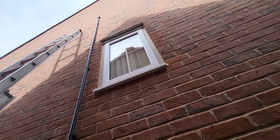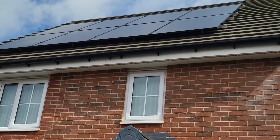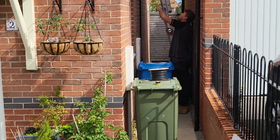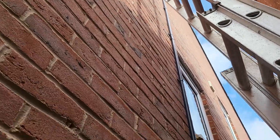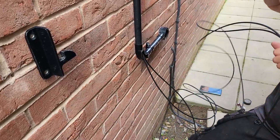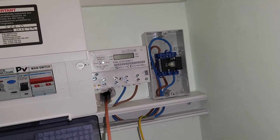He's also trying to get this AC cable drawn back up the conduit with some DC cables attached onto it, so we're using that as our draw wire. As I said, we're going to bring the DC string power down into this cupboard space. You can see Matthew here measuring the length of DC cable he needs to fasten on while Nathan draws that up into the loft space to join onto those existing string wires — ready for us to bring that DC energy down into our cupboard.